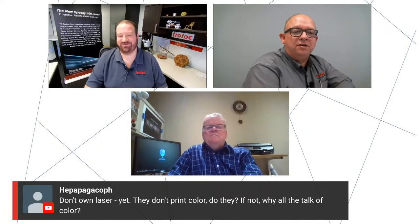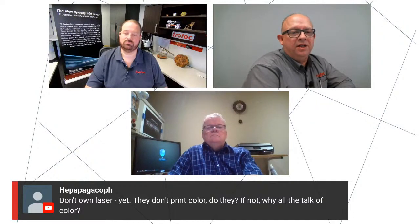Well, obviously we're burning and melting materials, so we get a reaction with the material we're using. We have a lot of ways that we can trick the system. There are multiple layer surfaces, like plastics, where we engrave one surface away and it exposes another. We can color fill if we use tape and stencil things. So there's a lot of things that we're adding color to, but yes, the laser itself does not truly print color. When we talk about colors with our color palette, we're really using those as information to direct our laser to do a certain task, and then have a power and speed setting that we can set with that. So normally we do a lot of black fill so that our laser can engrave, and then we do a lot of red hairline for our laser to understand that we want it to vector cut.